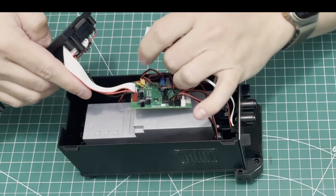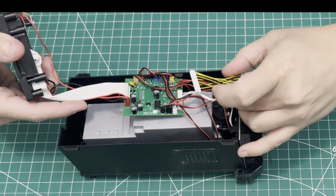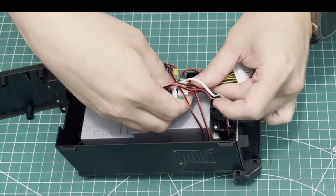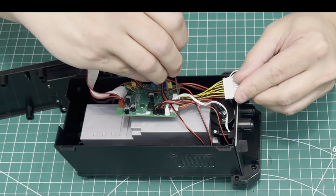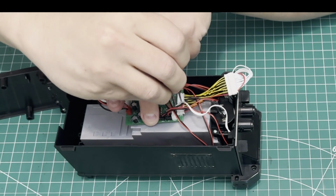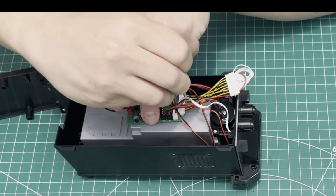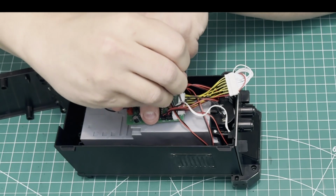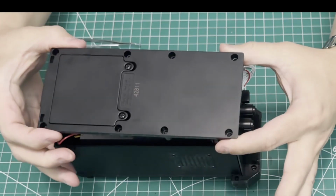The red wire orients in the same direction that the red wire orients on the other ribbon cable. And it makes sense to push the ribbon cable kind of down and under the cluster of wires there. It gives you the most space. I set it off to the side for a sec, grab my handy dandy tweezers, and I use this to push the connector in and make sure there's a good solid connection so this doesn't come apart when I'm cosplaying and running around all day. You wouldn't want your lights to stop working now, would ya? Use your tweezers there to make sure that the connector is fully seated.